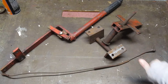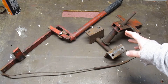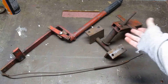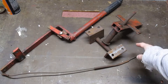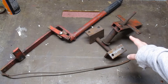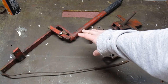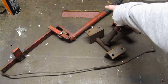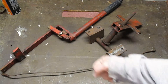There are two frame mounts and then the actual hitch itself. There are a couple variations of the hitches: early 1955s had the hitch completely made out of band iron, 1956 had a little bit of an open area in it, and this one happens to be a 1957, which is all sheet metal style. In the lift arms, 1955s did not have the actual lift lock — it was just a solid piece of bar stock in this area with an L-bracket kind of system.